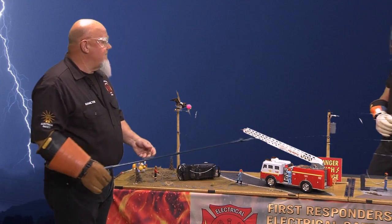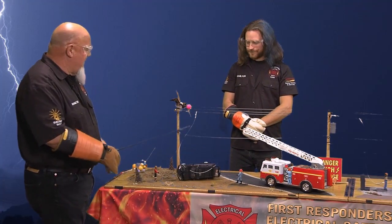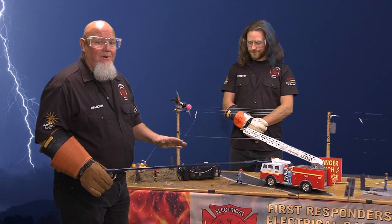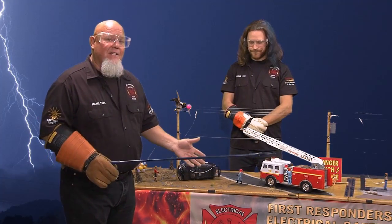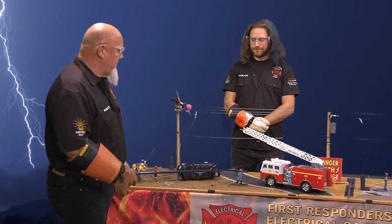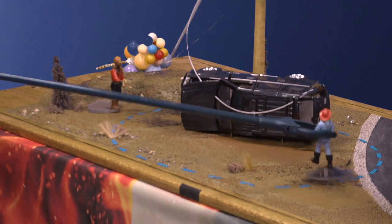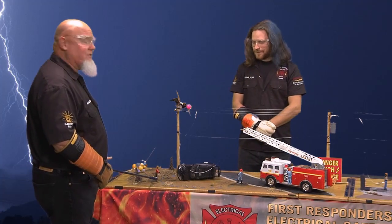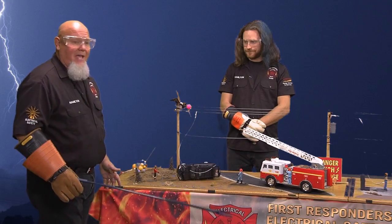You can probably hear that right now. There's 15,000 volts now transferring through those lines. We have a car accident here — the car is on its side and it's got a downed power line on it. Now, if you approach a car like this, or even a downed power line any place, remember: any place that that wire is touching the ground, it can move 30 feet in a circle. If you get inside that 30 feet, you're just like stepping on the wire. Let's say you're a first responder and you get up here and you step into that circle — boom, anybody that gets inside that circle is going to get it. If you get too close to the car, boom, that's what's going to happen.